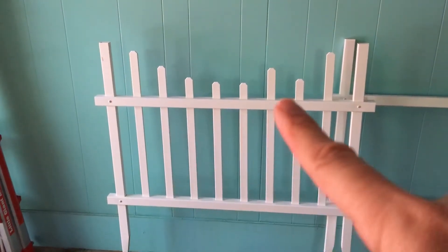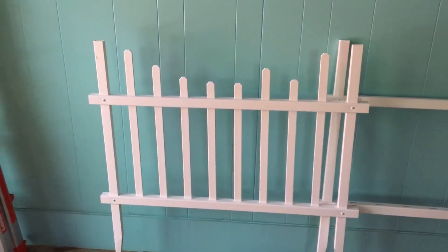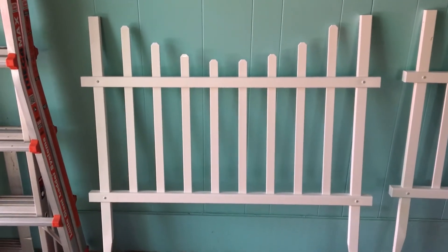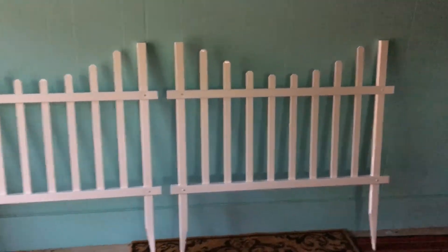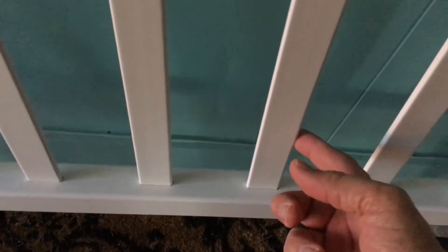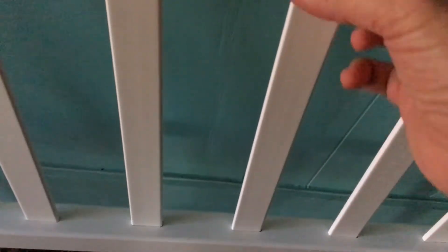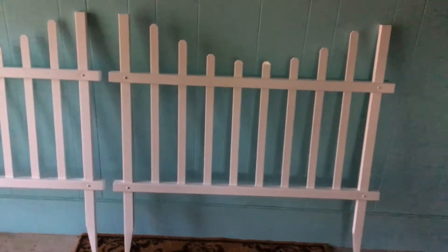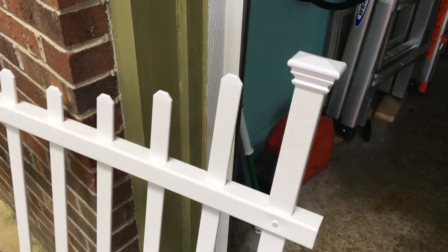Do the same thing for the rest — just go by the numbers and you won't go wrong. When done, you'll have that nice slope on your fence. To fix any misplaced picket, pull sharply on the bottom and it'll pop loose. Then instead of threading it from the top rail, come underneath it and that'll make reinstallation easy, just like all the others.